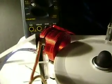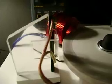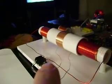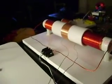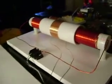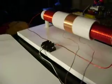But I'm running one of the big coils. The reed here is to run that coil. Then I have this reed taking the back EMF that's stored here and pulsing it to that primary on this transformer. This transformer is a little bigger than what I expected, but I like to go big and it seems to be working.